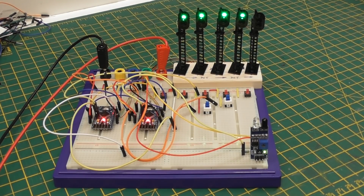And at the moment, those 2 times, 4 times altogether in one Arduino, 2 for each signal, are hard-coded. Well, they're hash-defined at the beginning of the code, so they're very easy to change. You don't have to find them in the code. You make one change for each delay, and that'll work throughout the code.